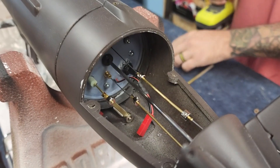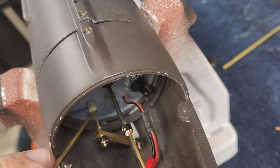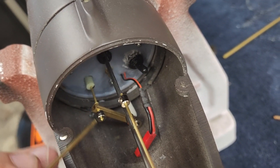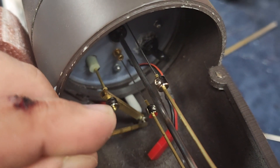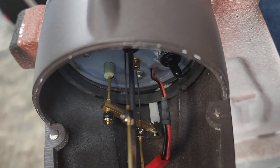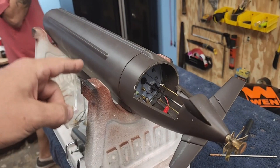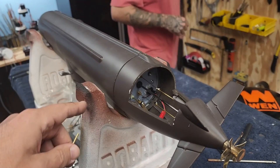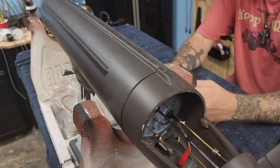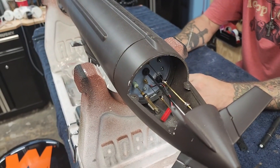Here is the solution we came up with. We've got a U-bracket - this is the linkage for the fore dive plane. It comes out to this sleeve that's fully adjustable right here, goes straight back to a magnet held in a wheel collar, and that goes to a magnetic connector that runs up to the dive planes. We can't test this until we get the new battery for this unit - it was built for a very specific battery that's coming tomorrow. The customer is coming at 8 o'clock on Friday.